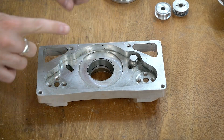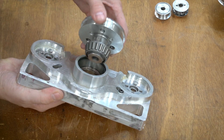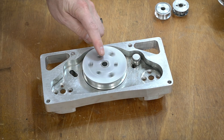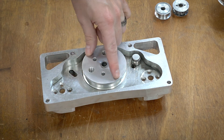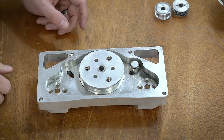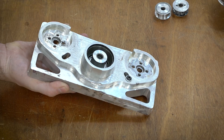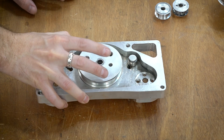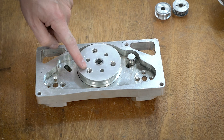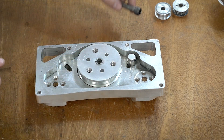As for the weapon block itself — I use these tapered roller bearings, one in the top and one in the bottom, and that allows this pulley to spin. But if you watch it, that is no longer concentric. These pulleys are the ultimate thing attaching to the weapon, holding all that power in place. You can see there's a sleeve on the bottom and another sleeve on top, and there's a titanium hat that sits on top holding the whole assembly tight. These sleeves are there because when it was just bare aluminum, the bolts' forces would just crush that aluminum in from any side load.